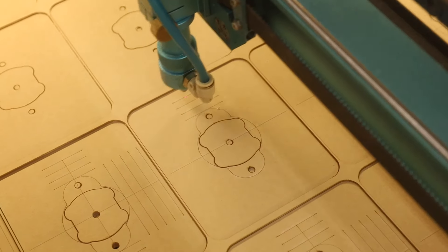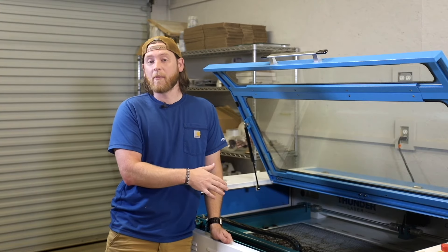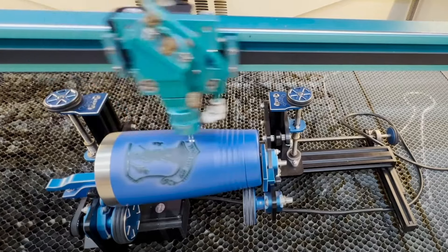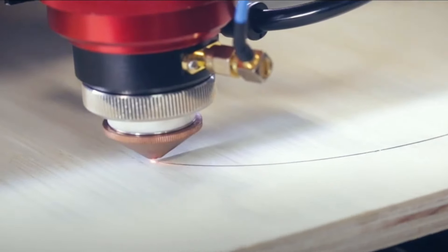Woods, MDFs, plastics can be lasered with very few limitations. These are usually the most common machine that can engrave Yeti and Stanley tumblers like you see everywhere, with the help of a rotary tool. CO2 lasers can range in a bunch of different sizes, from small desktop models all the way to large industrial beds. I think a CO2 laser is the most well-rounded unit because of its ability to cut so many materials and provide so many options of cutting styles. These units can cut much faster than some of their other laser counterparts.